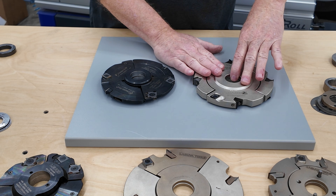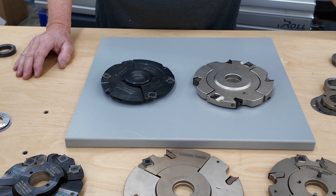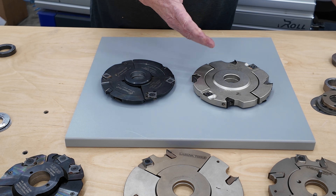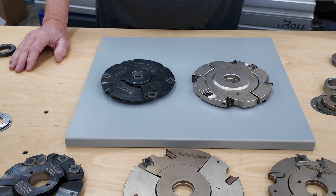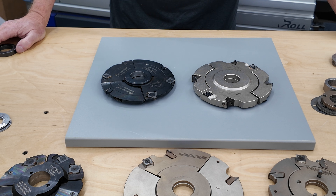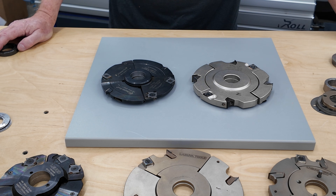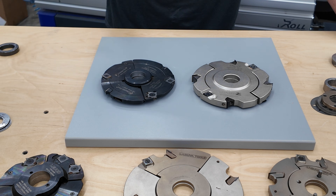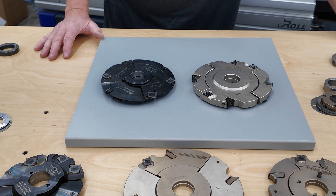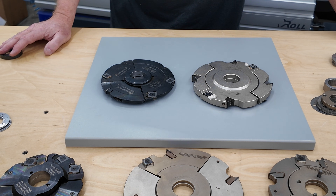Try to at least shoot for cutters of the same diameter, and if you do — or want to do — finger joints for drawers, that's a good choice. I'd love to hear your feedback. I probably use adjustable groovers more than any other shaper cutter; I find them incredibly useful and versatile. From a furniture and jewelry box standpoint, I now do all my drawers with adjustable groovers — there's no other means of joinery I use for them.